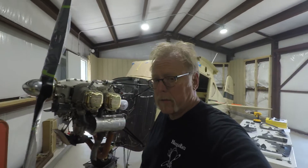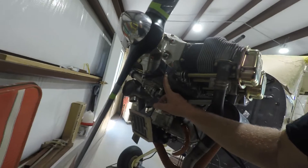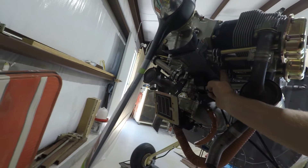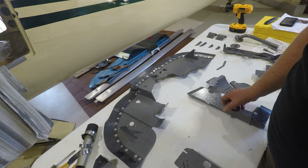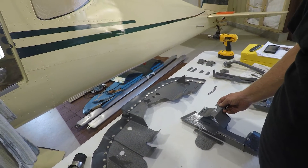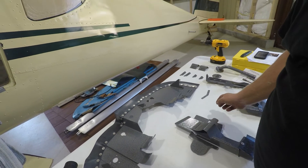It's a little hot in the hangar, but we've got the first two and a half pieces of baffle in. We have the lower scoop on the bottom of the crankcase area, then we have this other deflector that goes in. We learned that we put the inter-cylinder baffle in at the same time, because once you put this deflector in you're not going to be able to get the inter-cylinder baffle in. It's in there loose now because we've got to get some springs from Cessna. The deflector goes in like this and we're going to set this in loose — at least it'll be in place for when we get our new springs in. Bottom left is done, now on to the bottom right.